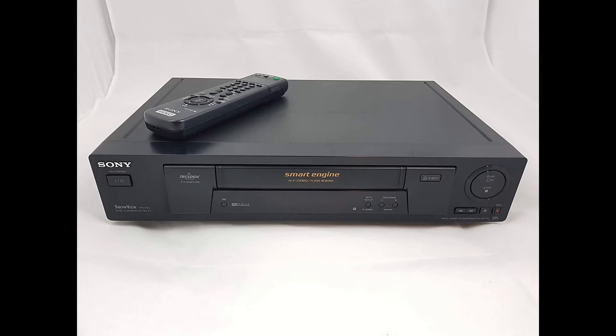The symptoms are: I can hit a button on the remote and it will likely respond. I can then hit further buttons and it probably won't respond, and the more I hit the less likely it is to respond. If I leave it alone for maybe 30 seconds and hit another button, it works. So in my case it's not the buttons themselves, it's not the battery, it's not the infrared LED — all of this seems to be working. Having fixed remotes a number of times in the past, I discovered that there were no good tutorials on YouTube, so here we are.